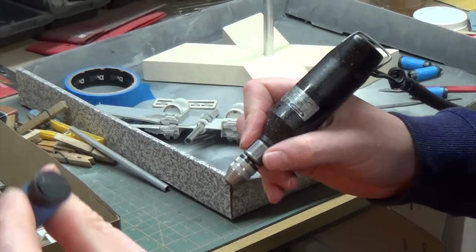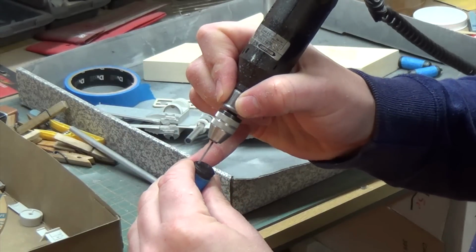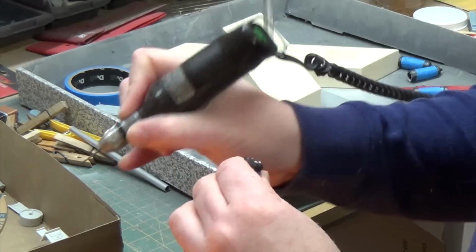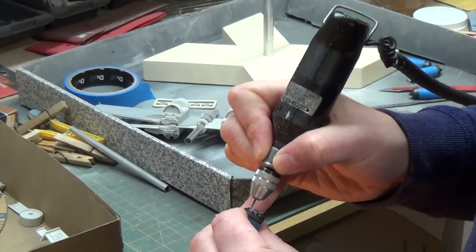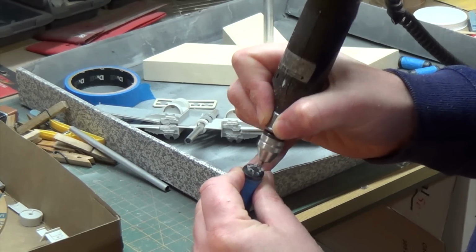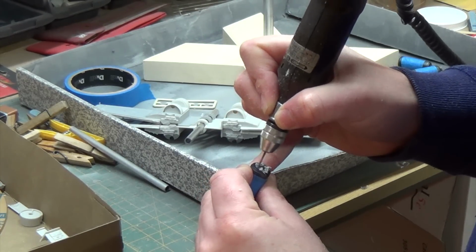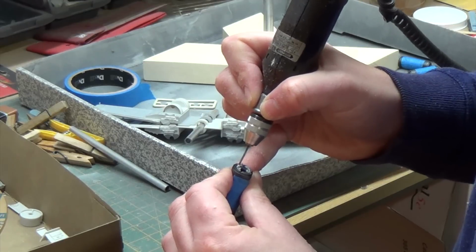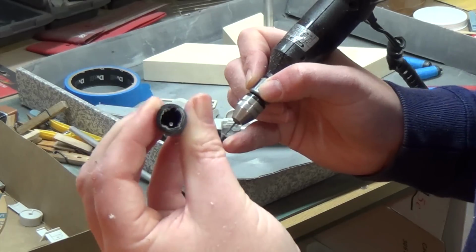So what I'm going to basically do here is draw a clock face of holes with the drill. So I'm using the tape and I'm just holding the two sides together. They're not glued yet. So I'm just going to put 4 holes at the compass points, north, south, east, west if you like, and then I'm just going to join the dots. Hopefully you can see what I'm doing. A bit harder to do it while I'm trying to hold it so the camera can see. Go again there. So just join up these last few holes now. So now we've got a nice big hole which we can tidy up.